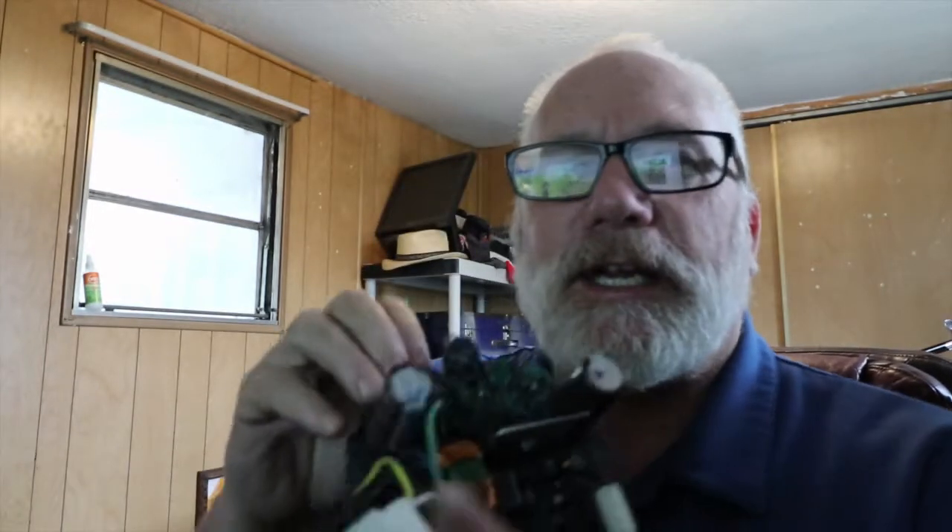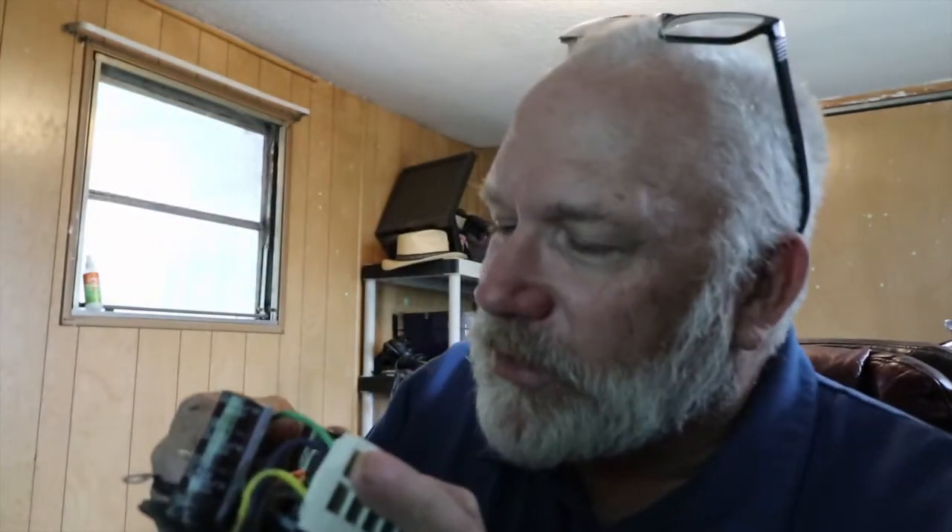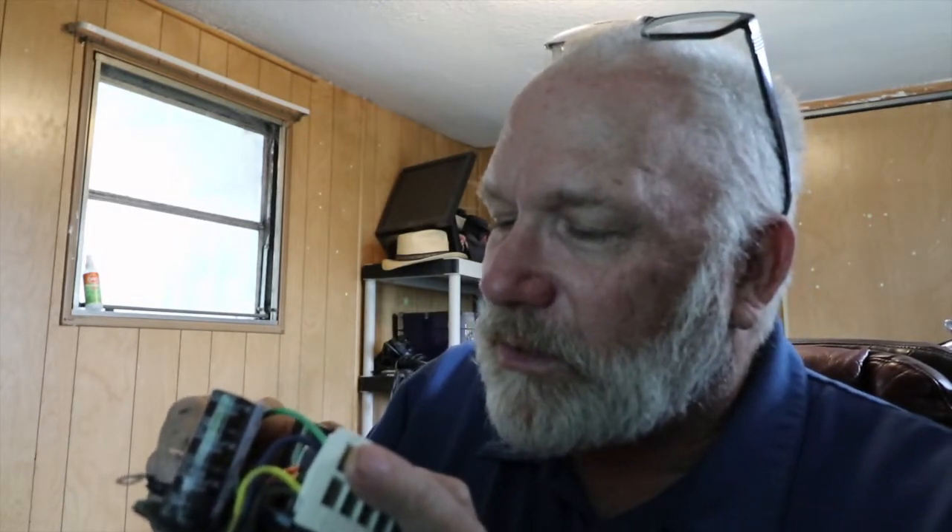Many of these motors are pretty easily checked. This thermistor right here is the inrush thermistor. You can readily read the numbers on there: SL 22 1R 0207. Now, do not be deceived by people on the internet - right now there are people on YouTube trying to sell you this thermistor for $25.